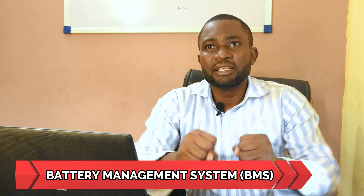One of the functions is active balancing of charging and discharging. Temperature control is also very important — you need an ideal temperature for your battery while charging and discharging, because when the temperature is not uniform, the acidic content of the battery works very hard, which reduces the battery's efficacy. There is also charging rate control, so that sometimes you charge faster and sometimes slower. These are the functions of the battery management system, ensuring optimum performance.